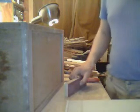because I'm not going to use a plane, because it's a very hard kind of plywood. I think this is watertight glue. This is a watertight multiplex plywood, and it ruins your plane. That's why I'm going to try to saw as accurately as possible and then sand it till I am at the line. And then once we did that, we can place it back and estimate how much we have to saw from the front. I will saw it now.